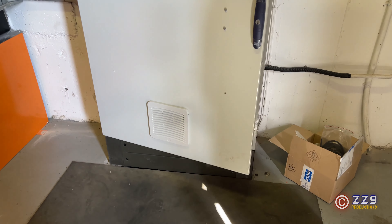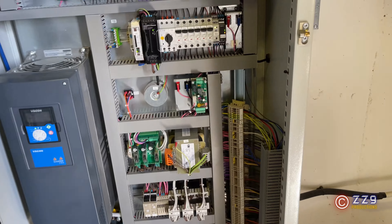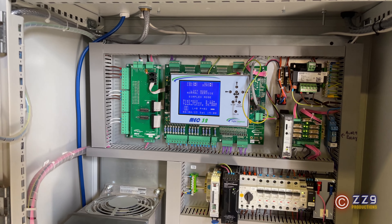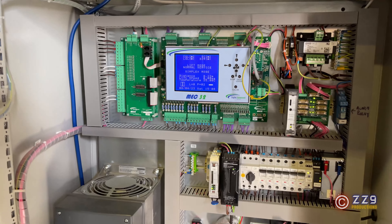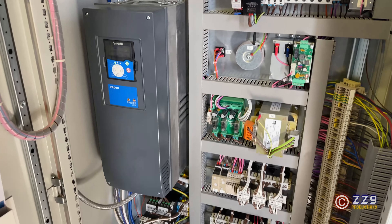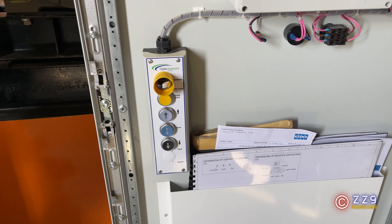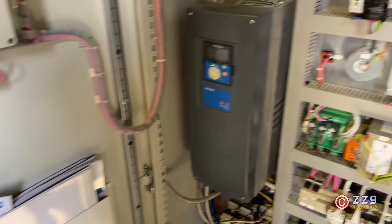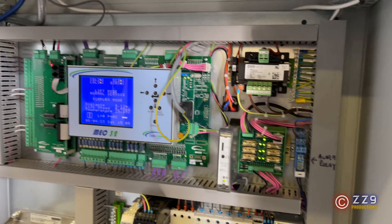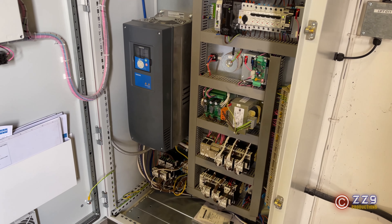We'll have a look at Number 11 then — it's probably much the same. Slightly different layout but pretty much the same unit, I think. Mech 32 Digital Advance, same VF. Yeah, much the same, just slightly different layout of the controls. There's the inspection control, some relays and things. And there we are — that is Digital Advance logic behind Goods Lifts 10 and 11.